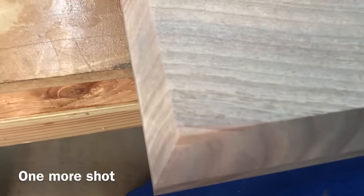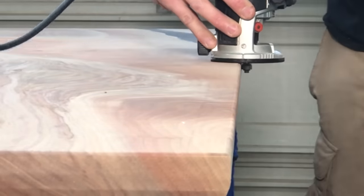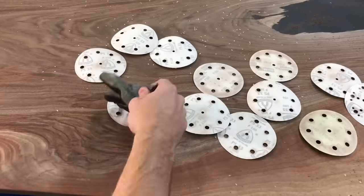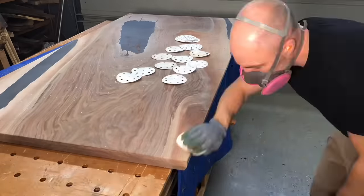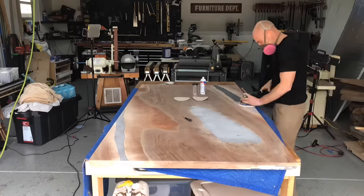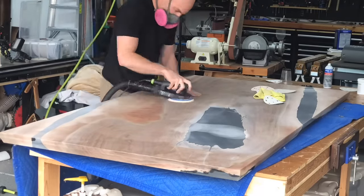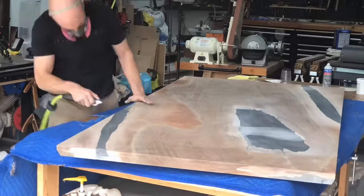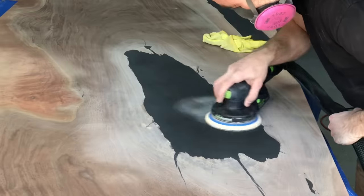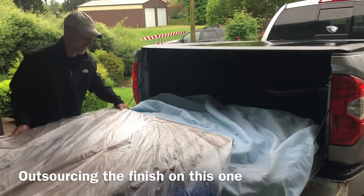So that corner was a little bit of a hangup, but now we're finally ready to move on with the rest of the build. After sanding, I believe I actually sand up to 120 grit, then I come back with my eighth-inch router bit and my trim router, hit that top corner with the eighth-inch round-over, and then continue the sanding process. I need to smooth out those router marks with my sanding glove and some old sandpaper — hand sanding the side to 150, then 220. The wood is much more forgiving than the black epoxy. I'm really taking my time, using a microfiber to wipe it off, crossing it back and forth, side to side, circular motion — making sure it all looks uniform before taking it to finish.